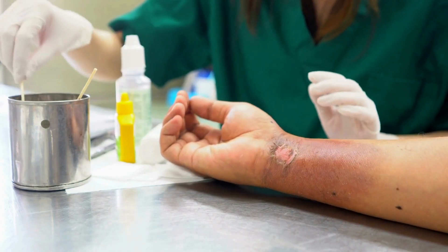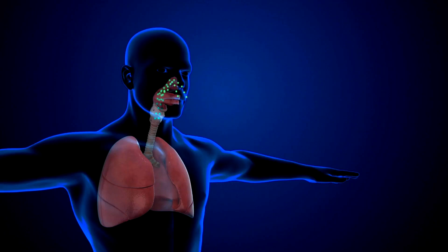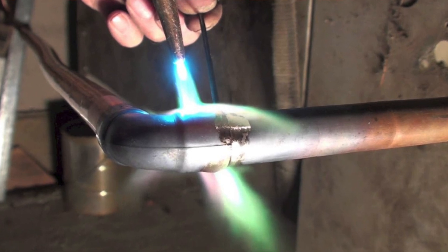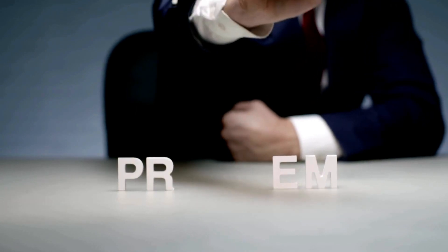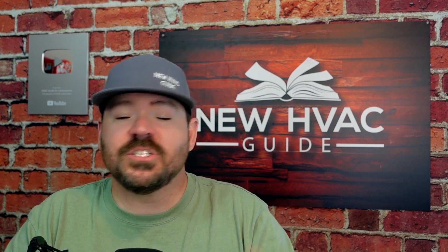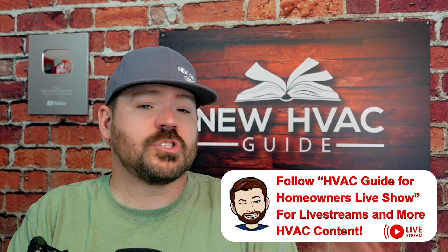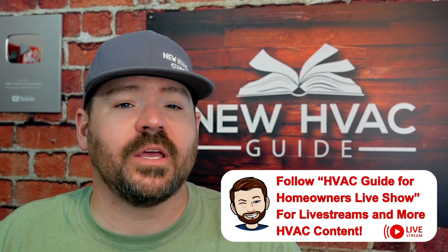Number six is safety. No longer do you have to worry about using an open flame — the heat causing burns, possibly burning someone's house down, or breathing in brazing fumes. I've seen guys burn themselves because of it. Maybe not life-changing injuries or houses burned down, but press fittings simply eliminate that safety issue. You don't have to keep a fire extinguisher quite so close. The heat that could ruin certain components is just no longer there. Guys use gels or putties to protect service valves and metering devices when brazing — press fittings eliminate all that.